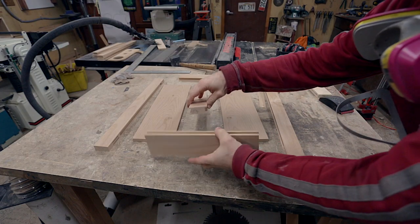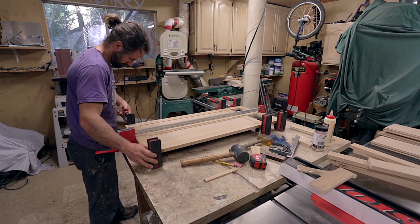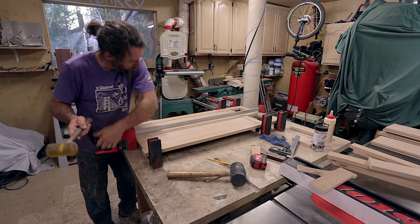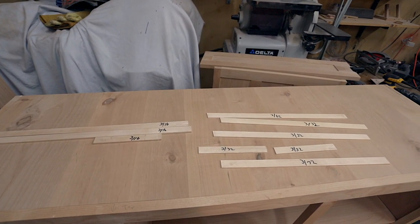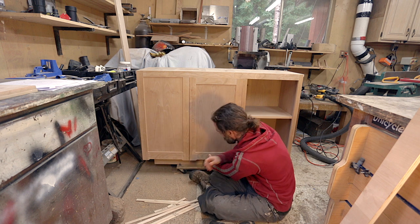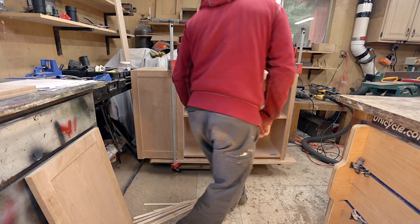Some additional notes on doors that have a centerpiece: I don't cut a biscuit on those — they are glued in but basically just float. For a more complex door like one of my top doors, I have to clamp it in three different locations in the width and one in the height to hold it all together tightly. Once the glue dries, the next step is to make the 3/32 inch spacers. My door design has no bottom frame for alignment, so it doesn't need any trimming there — I just have to trim the top and the two sides. I grab a couple clamps and clamp on a piece of plywood so I can set the door on top of that.